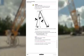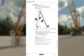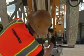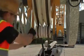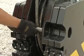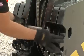Please refer to the operating manual for the ideal boom position depending on the boom configuration. Now, mount the rope protection on the jib head again. If required, reave the hook. For the various reaving possibilities, please refer to the operating manual. Connect the rope socket to the dead-end lug.